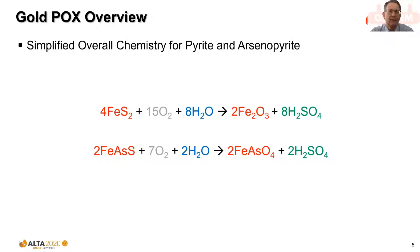These are the very simplistic reactions for the two main hosts we come across — auriferous pyrite or arsenopyrite. The reaction above shows pyrite decomposition through to hematite, although it could be to jarosite or basic iron sulphate. Below, arsenopyrite goes through to scorodite, the stable precipitate of ferric arsenate. The real chemistry is far more complex, and I haven't shown the gangue mineralogy here, but this should indicate the inputs and outputs.